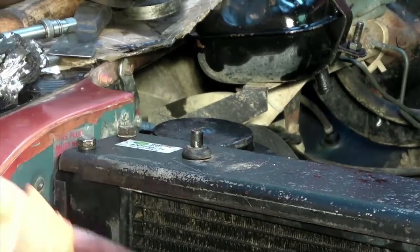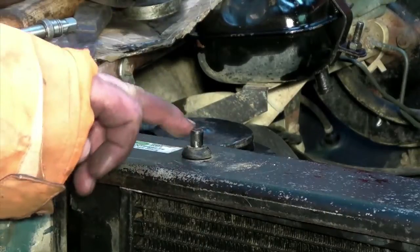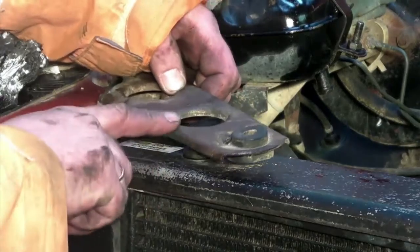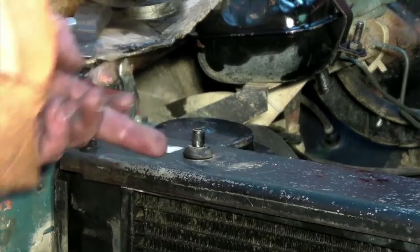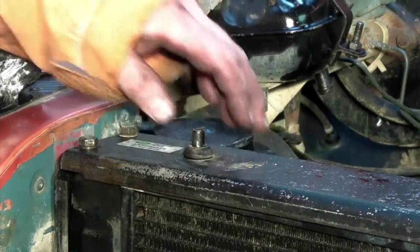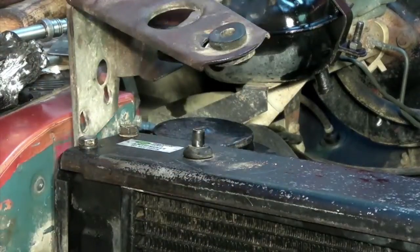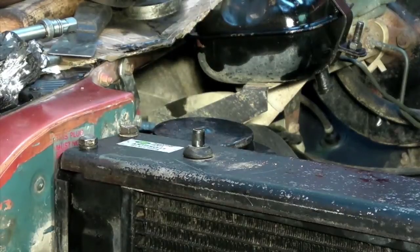What you'll see here is one of the radiator pegs is going to get in the way — it comes through here where the bracket is, and will just about fit through that hole. But when you actually square this up it won't be right, so I'm going to cut that off with the angle grinder, clean these faces down, fit this bracket temporarily, tack it in place with the pegs, and then weld it up.